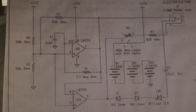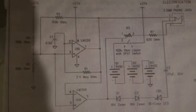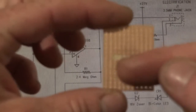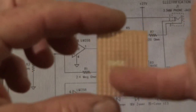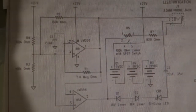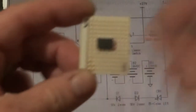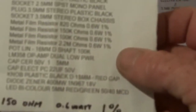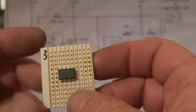I've got a picture of the little chip. First of all, what you want to do is get a little board and cut it out basically like that. On the bottom of the board, you want to cut out four tracks so this side of the track is not touching that side. I've basically left two tracks and measured seven up, then cut a little rectangle out of there. Then get the LM358 — you just need to show the electronics shop what parts you need and they'll get them for you.